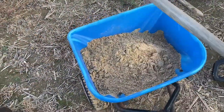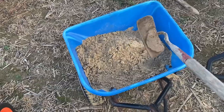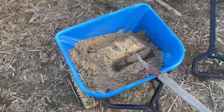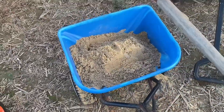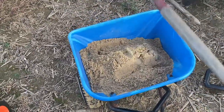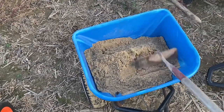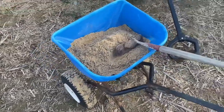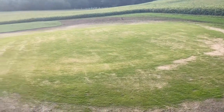Now that I have it filled up, you're going to use a hoe — any type of hoe. You wouldn't even have to use a hoe, but this is nice because you can use it to scoop it. What's going to happen is this is going to clump at the bottom. So as I'm walking with it wide open, I'm going to be tapping on this. You don't want to fill it too full, but you tap it just like this and it causes the whole thing to vibrate, and it's going to cause the sand to come out really nice. You're going to cover your whole area with it, and then you're going to brush it in.